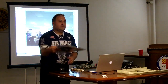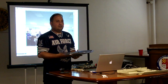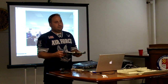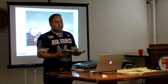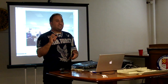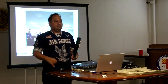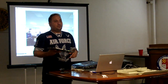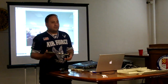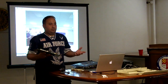Did any of the Pluses use those jumpers, the memory jumpers? Only on the 2s, the original Integer BASIC ones? Yeah, they actually used those jumpers because the first ones came out with 4K chips. Even the 2 Plus? They knew they were going to go to 16K shortly, so that's why they did it. By the 2 Pluses, all you saw were 16Ks installed already, because they just used the boards up. They took out the blocks altogether. And then at this point, by about Rev 3 or Rev 4, the blocks disappeared. They just wired them. It wasn't uncommon to get an early 2 Plus with them in there. They were installed by Apple.